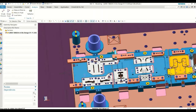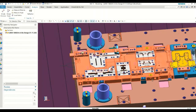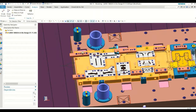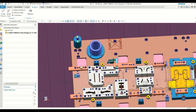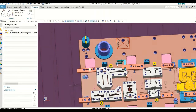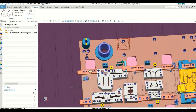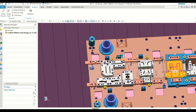We could use small little pins also — that's also a small little block, that's also okay — but this is a bigger one. We have six gas springs in our die. We only use gas springs; we don't use coil springs. Had we used smaller lifter pins instead, we again would have had to use gas springs. So it is more economical and better to use the lifter block.